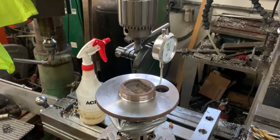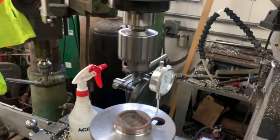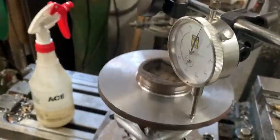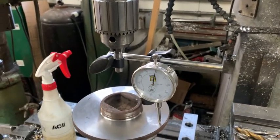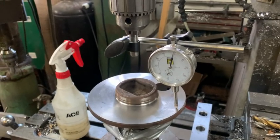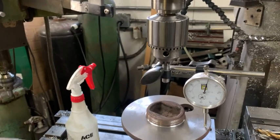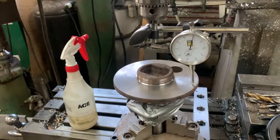I got it in the chuck, it's trammed in. The only issue is when you bring your turret out — it doesn't matter if it's a Bridgeport or a knockoff — when you bring it out that much, it always has to be re-trammed. I got it within about a thou, so we'll call that good. Some guys at work don't bother to tram it and then wonder why their bolt circles are off — because they didn't bother to re-tram the spindle to the actual axis of the work. The lines of zero on the head, never trust them — it was only out about five or six thou, which I know because my parallels are good.